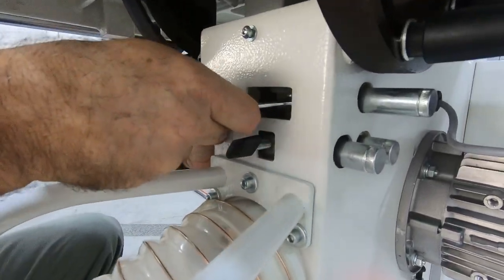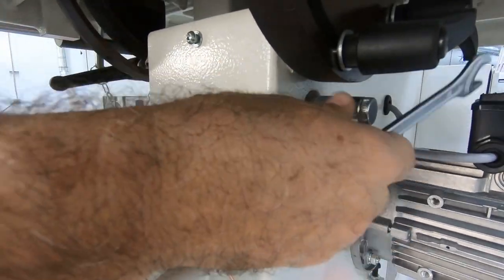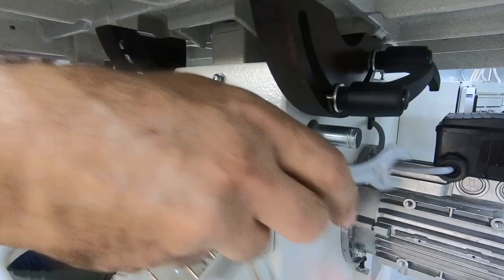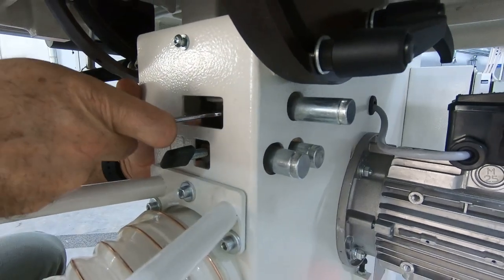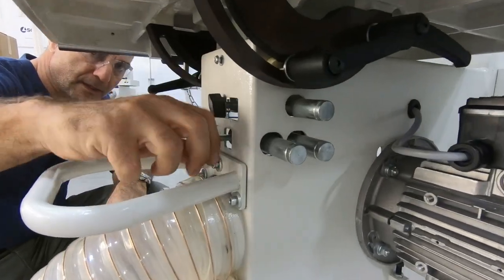Here you can see me unlock the lower guide assembly to orient the whole system in line with the blade. Once that is done, the adjustment of the guides themselves is the same as if it was the upper guides. Again, no tools required. For day-to-day operations, that is.